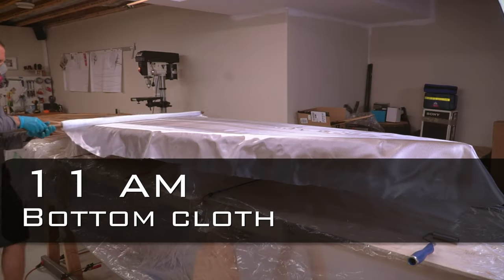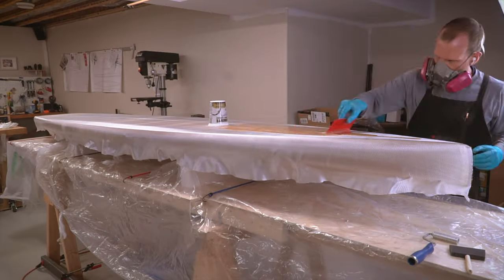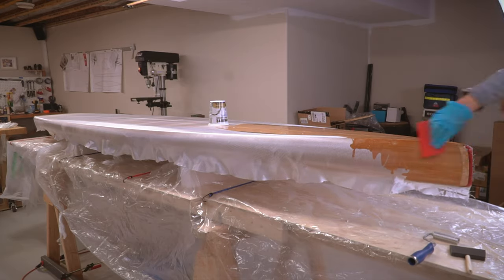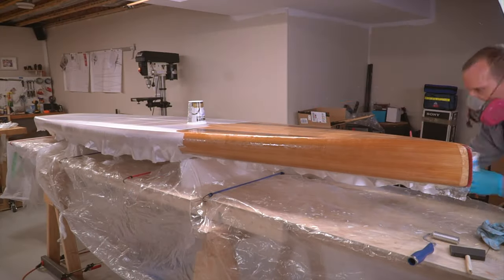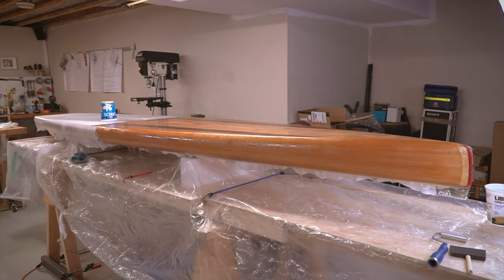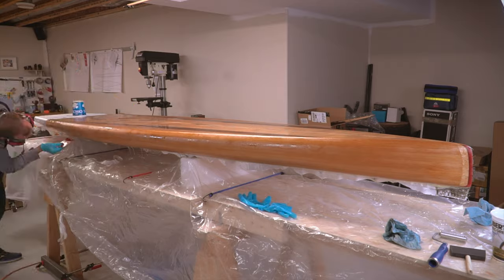It's been a few hours and now the cheater coat is no longer tacky, so it's time for the first layer of cloth. I started by unrolling the previously cut piece onto the board and smoothing it out carefully. Then came a coat of epoxy to wet out the cloth. I'm working from one end to the other and mixing up small batches of epoxy that can be spread out quickly. If the epoxy spends too much time in the cup, it can harden too quickly and that's not good. I'm working in sections — mixing epoxy, spreading it out, and then going back to squeegee out the excess once it has fully saturated the cloth. After a few hours, the first layer was done.